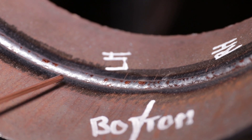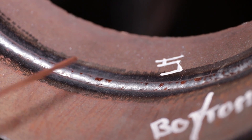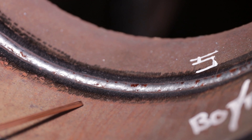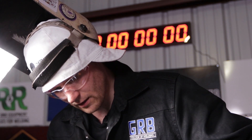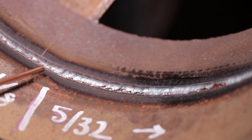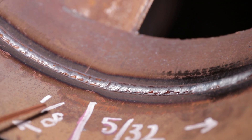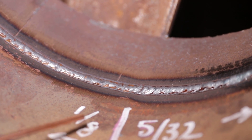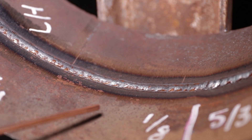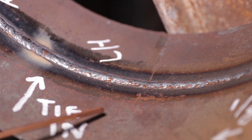This was done with a 5/32 filler metal — the 5/32 deposits more metal. It's easier to use 5/32 on larger diameter piping, say 12-inch or 14-inch, because you don't have to feed as much metal. Coming up to where I used 1/8th filler metal — right around here it switches to 1/8th. The reason I switched is because I did not want a heavy build-up on top. The 5/32 has more build-up at the bottom, which is relatively helpful, but 1/8th keeps a more uniform bead and it's less deposition in comparison to the 5/32.